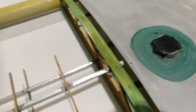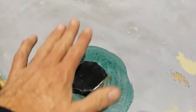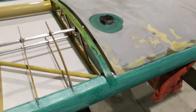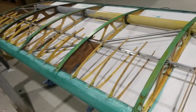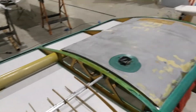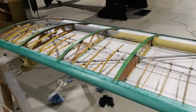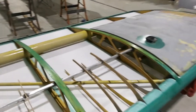It's going to look a little bit ugly around the tank area — not as defined as when you use a nice patch or wooden disk like I had on my other Kitfox to keep everything off. Since this tank is flush, I don't have that option. I only want the fabric to stick around the edge here, not to the tank itself, because I know it'll look ugly. We'll see how that pans out. All the glue is dry, so I'll put the fabric on now, press it in with the iron set light to tack it in position, flip it over, fully glue the underneath, brush the glue through, wipe it off, let it set, and then put a first stage of shrink on the fabric at about 250 Fahrenheit.